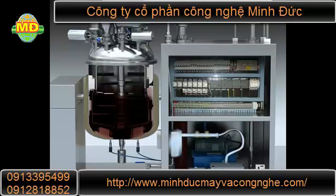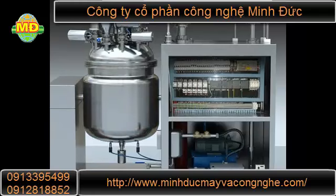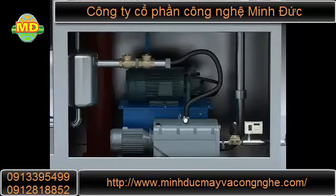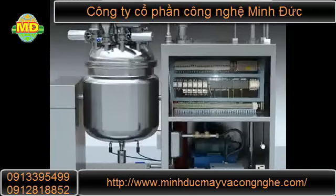The vacuum meter displays the vacuum degree of the tank, and the vacuum protective sensor will keep the liquid pressure in normal state. 3. Hydraulic system. It is made up of hydraulic pump, hydraulic cylinder, reversing solenoid valve, overflow valve, upper limit switch, lower limit switch, discharge protection range, safety switch.